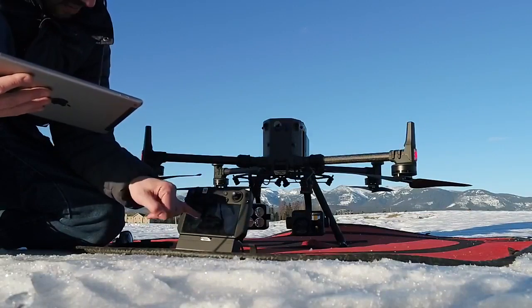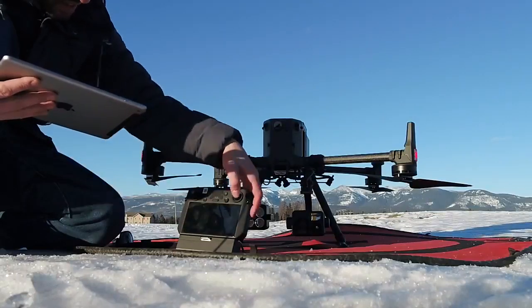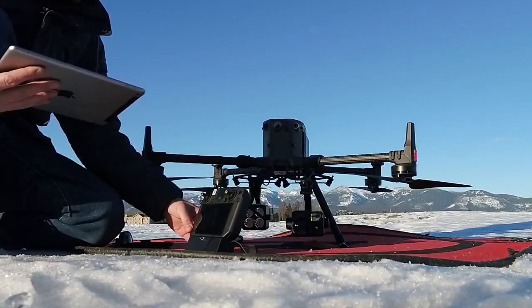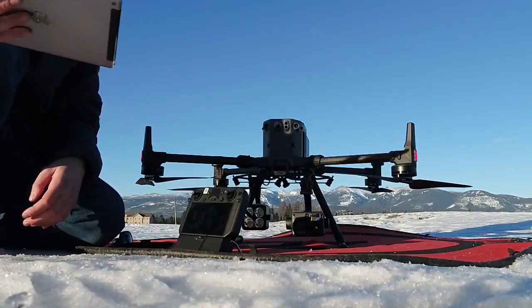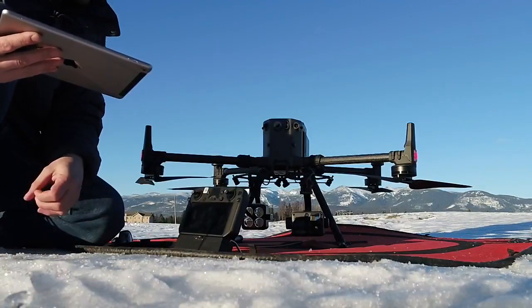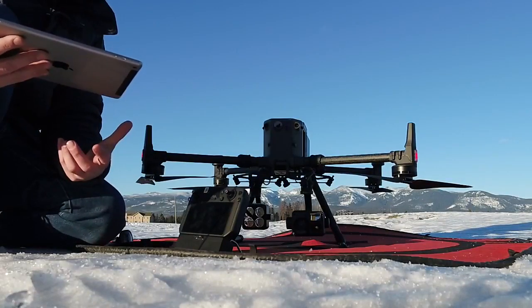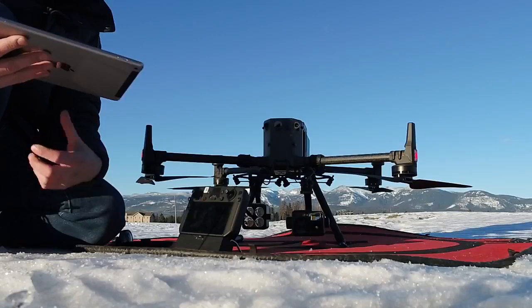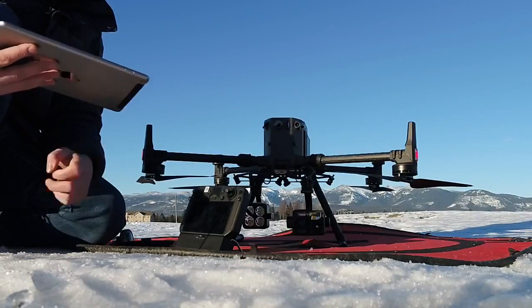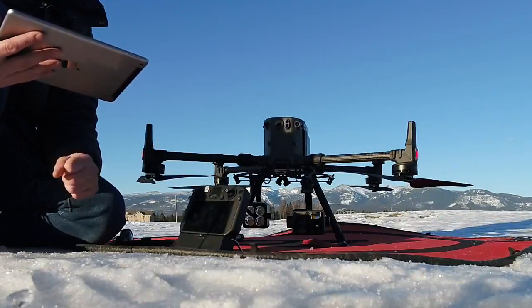The spotlight's pretty bright. There are no settings on the main screen for the spotlight — you've got to go into your menu settings and you'll see a little third-party payload wheel in there, and then you could fire it up from there. The H20T thermal sensor — DJI put their own sensor in there. It's a DJI thermal, 640 by 512, taking radiometric JPEG images. You could still use FLIR tools for that, but really they're trying to have people use the DJI thermal analysis tool, so you can do everything you need to in post if you didn't get it quite right out in the field.